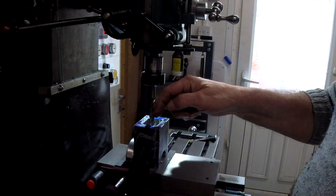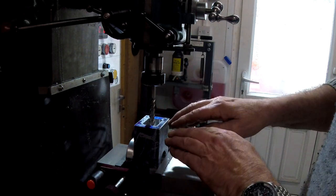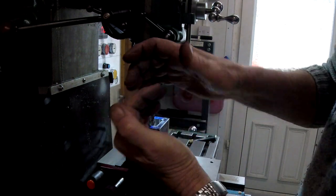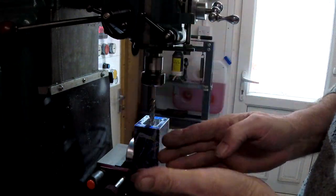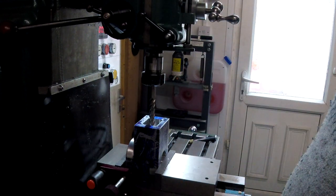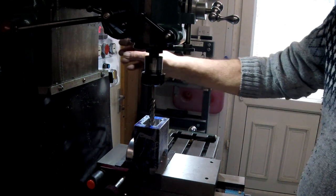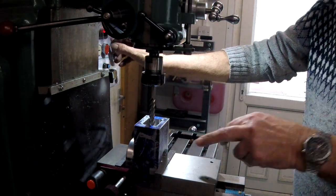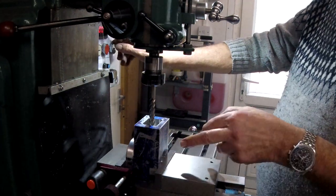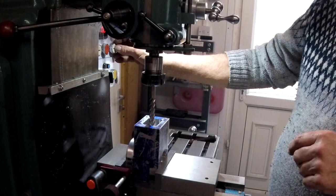So I'm only cutting a channel, I'm cutting down the sides, so it'll be round the cylinder bore, the side will be cut away, and underneath it, so you've got to get a bit of a thermosiphon going. They say it's not necessarily at all, it's just for show, really. So, okay. I'm going to break through in the middle first, because the swarf can fall down. It's a nightmare clearing the swarf out all the time.